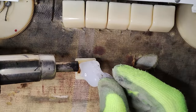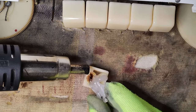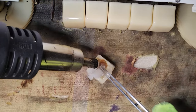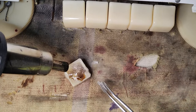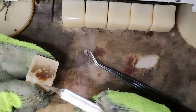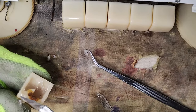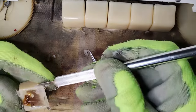The off switch button was loose and appeared to have been glued on before. To fix the button back to its lever, hot glue was used because it can be adjusted or removed later if necessary. These clips show the process. Reusing hot glue leftovers, using the hot air gun just above the glue melting temperature to avoid damaging the plastic.